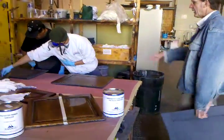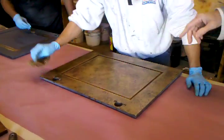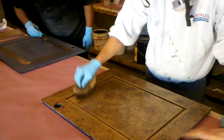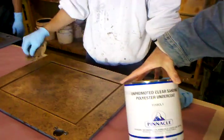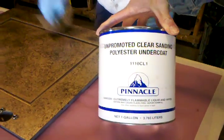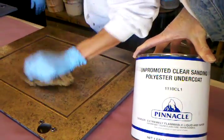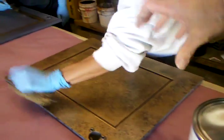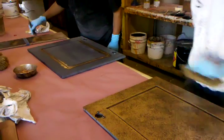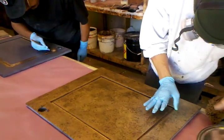The next step is the application of the gold. This is gold powder, crust light powder that's been embedded. We use as the vehicle the Ellis brand clear polyester undercoat or sanding sealant, and we use that almost as the glue medium for the material. The powder goes into the catalyzed polyester and then in this case stippled and ragged on with natural sea sponges and brushes.